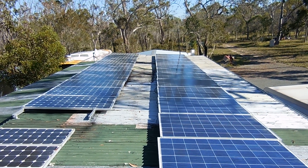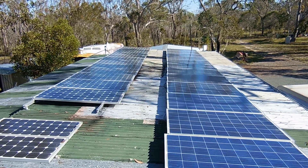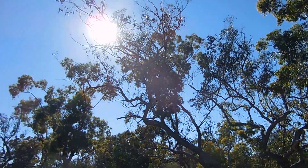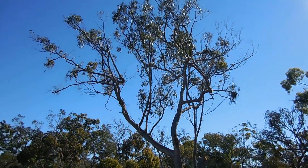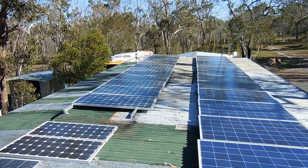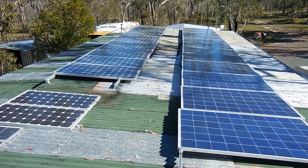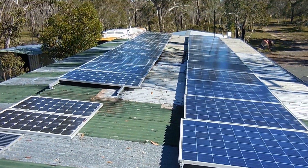First thing to note, you'll see a bit of shadowing on the panels. Now that we're in June here in Australia, we're just at the start of winter, so the sun is obviously lower and we're getting some shading from this tree in front of the house. In midsummer it's nearly directly overhead. The batteries were taking a lot longer to charge — before they'd be charged by 9 or 10 o'clock in the morning, but now, depending on overnight power use, they may not get charged until 12 or 1 o'clock in the afternoon with the existing 2kW on the panels.